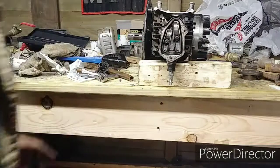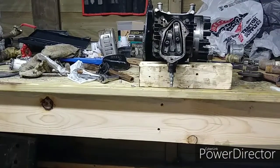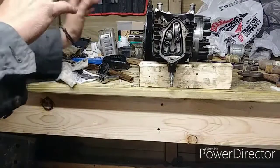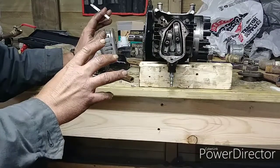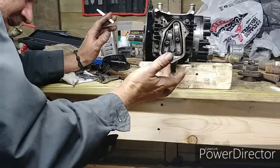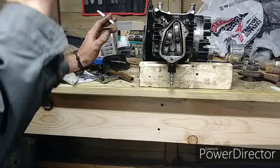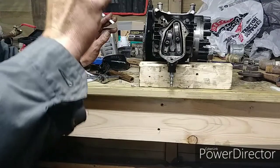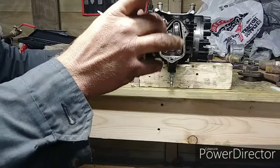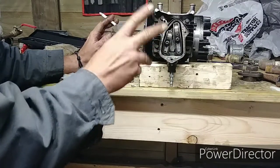Let's let the pressure build up and we'll crank it back up. Let's go again. Like I said, I think the timing's just a little bit off. And there's still a leak in this manifold — we'll have to figure out something different with that. Actually, I could just use that water weld. I think it's off like a tooth or maybe two.